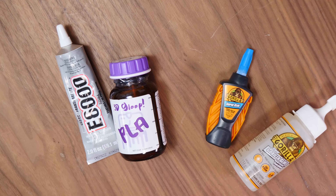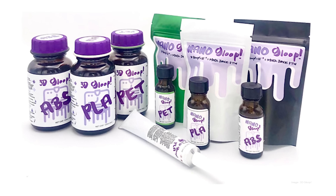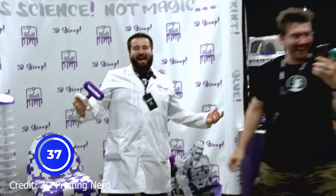Fortunately, there are actually much better ways to bond your 3D prints together, ranging from rubber cement or E6000 if you need a little bit of give and eventual removability, to specialized epoxies when you need a permanent bond. You can use any old two-part epoxy such as JB Weld, but personally I've been using the specialized version called 3D Gloop, which is available for PLA, PETG, and ABS. This stuff is so strong they've done crazy demos at different trade shows, and my experience has been pretty much the same. 3D Gloop didn't sponsor this video, but hopefully someone from their team sees it because I've really been enjoying the product.